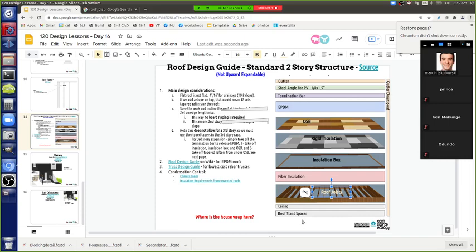Let's divvy this up and do one thing at a time. So let's not worry about the slant yet. Let's discuss the slant. In order to keep this all simple, not cutting any joists to an angle, we're going to keep everything a box and just raise one side of it 4 inches. It's an easy way to do it, and you won't even notice that it's slanted.